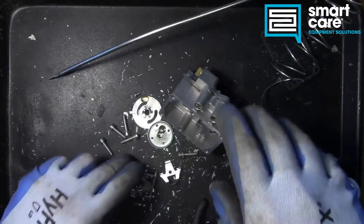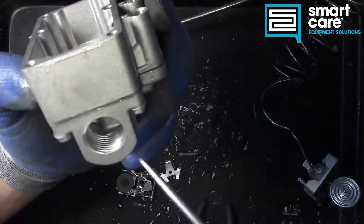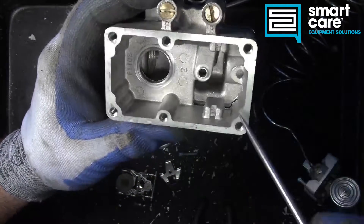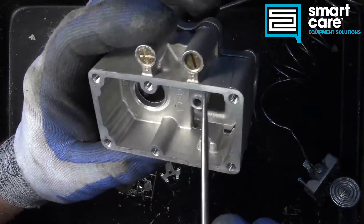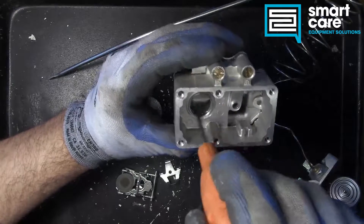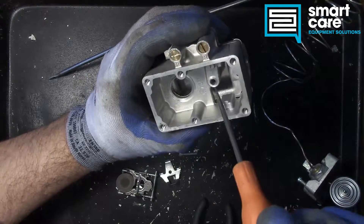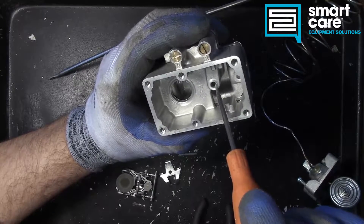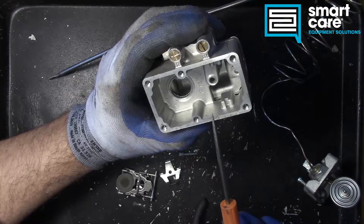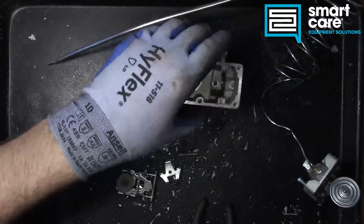This entire mechanism pivots in there. Looking at the inside of the body, you can see the incoming gas comes up and through. We have our bypass port feeding out the side, and then our main gas going down through the larger opening. The reason they've got a seal on the bypass port is likely so that if the valve is turned to a fully off position, it also shuts down the bypass gas.